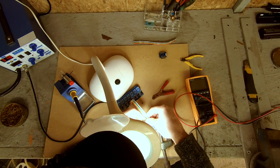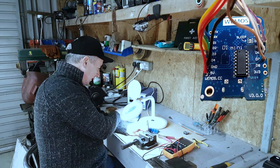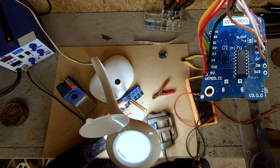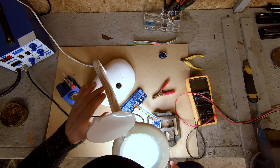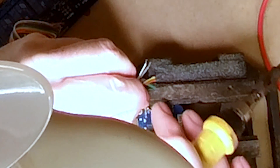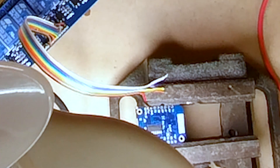Okay, let's put the red in the five-volt one. Get the rest out of the way for a minute. Let's add a little bit of solder — just put a little bit of solder on this hole. Okay, that's in there — I've got the red. Okay, so that's the red in. Now we want to do the black — that's the red on the five volts. The black is ground, so we'll hit the hole with a bit of solder. Okay, that's nice, it's in. And we'll get the five-volt wire in — I'm just heating this now, make it hot, melt it, push the wire in. There we go, done. Five-volt red in.